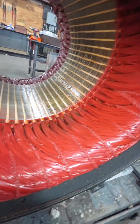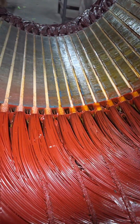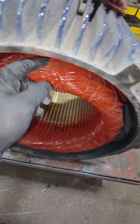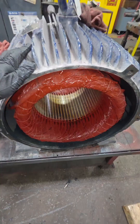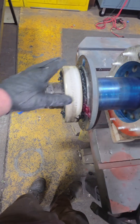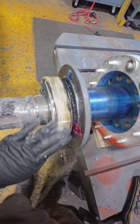Back to business — we're going to visually inspect this winding. I don't see anything that sticks out as abnormal. Very clean winding, very clean electric motor; obviously not a bunch of material is getting inside of here. Now we can take a look at our insulated bearings — you can see that white outer housing around the bearing which normally would be metallic, but these things can't conduct electricity.